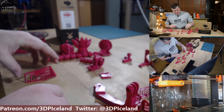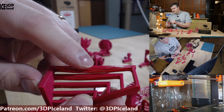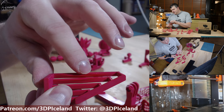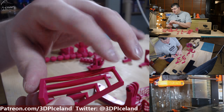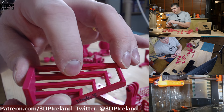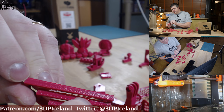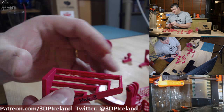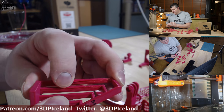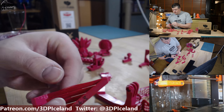With bridging on the MK2 there were slight issues on the longest bridge — the three shorter ones did very well but the longer ones had small issues. On the MK3 printer it was quite good, with only a small issue at the longest bridge and one strand of filament getting slightly loose. The MK3's part cooling is better. So keep in mind that since this filament prints very hot, you need a good part cooling fan to get good bridging results.